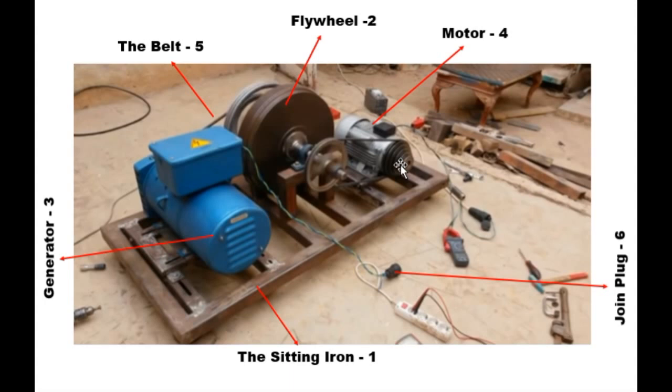The motor is like the engine. I told you that the motor must be mounted in this system — in the bar — so that it will not shift. Because when it shifts, the belt becomes sloped, and when it's sloped you cannot have a good output from the generator, because it's the motor that drives the generator. Remember, the motor drives the generator. So you must be able to get the motor very, very firmly fixed.